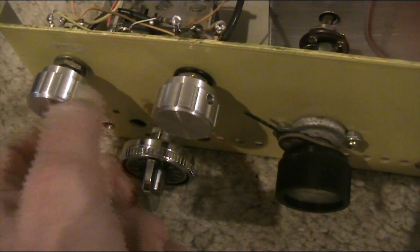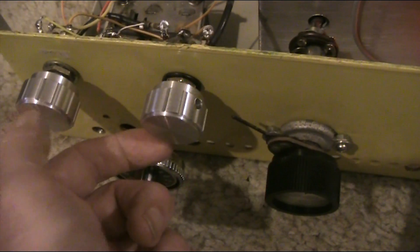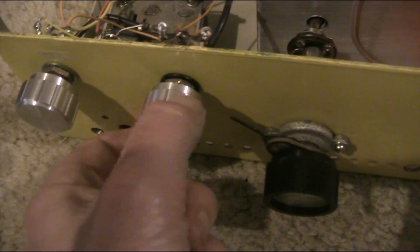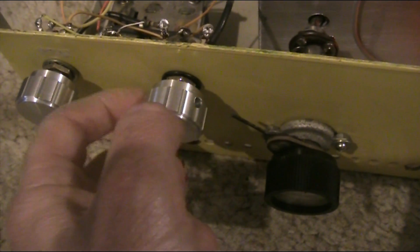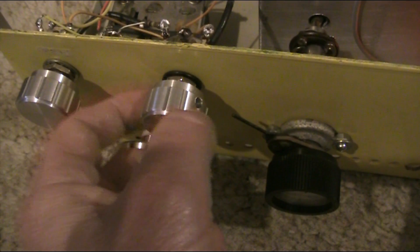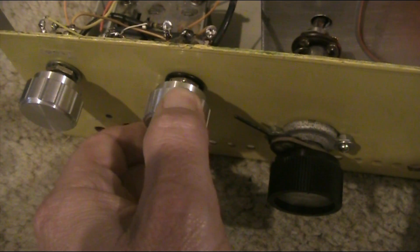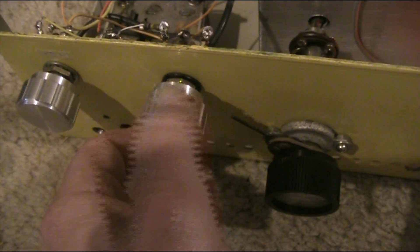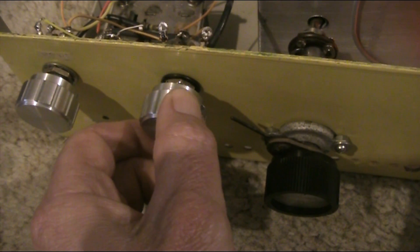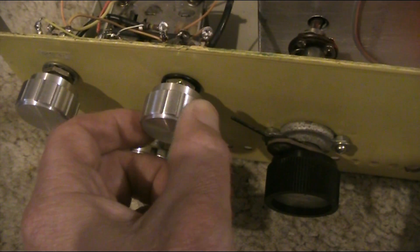There are several controls. This is the AGC setting for the TVtuner — you normally just set it to maximum gain. Here is the bias adjustment on the transistor, which is sort of a regeneration control. It does all sorts of things. If you set it up here, it stops oscillating. Then you advance it a bit more and it goes quieter and then stops.